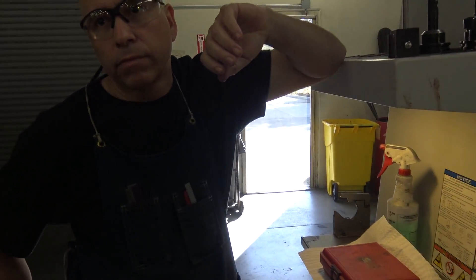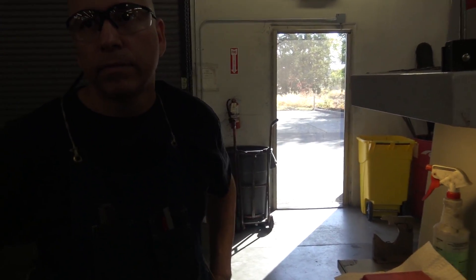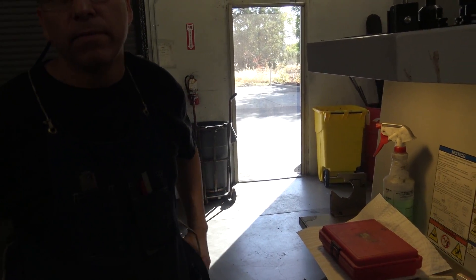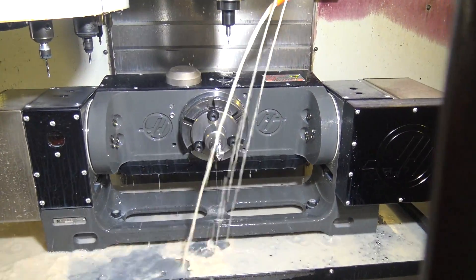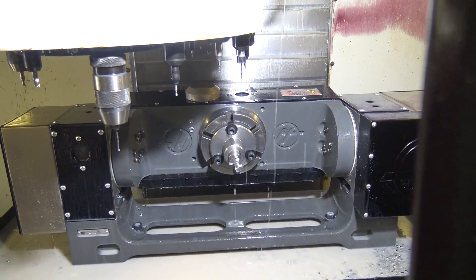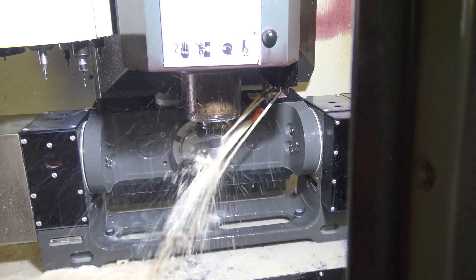So that's a form of hard milling. They've been heat-treated to 36 to 38 Rockwell — so not too crazy hard. It kind of eats up the little end mills, but not too bad. When you're making a chip, the material is what matters. There's a chamfer ring, and a relief on the pocket wall.